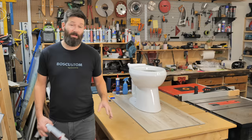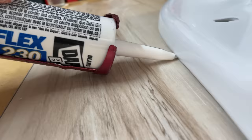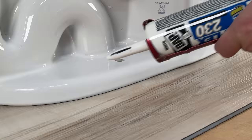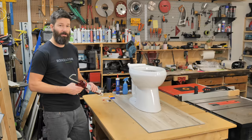When it comes to cutting the tip, I like to cut it nice and big on a bit of an angle. You want to make sure you're going to get proper contact on the toilet and the floor at the same time in one pass. If you're going to err, err on the side of cutting a little bigger. I like to put a little line on the top just so you know what's going on with the tube at all times. When applying, put it down in a pushing motion — if you're dragging the tube it's not going to get as good contact as if you're pushing the caulking out front and running through it with the rest of the gun.